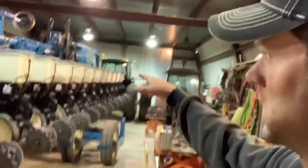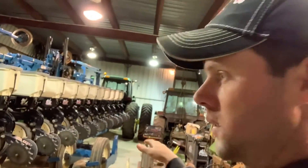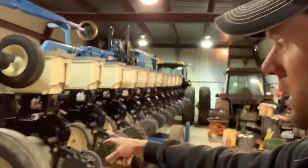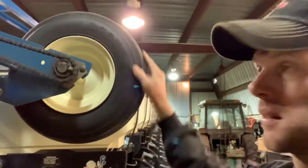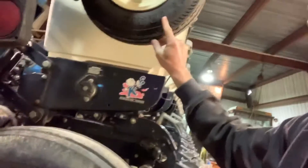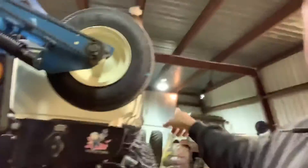Of course you also have wing locks — you have a center section and a wing on each side. The wings make it so that when you're going over uneven terrain, it will let that side go down on the low side, whichever side is low, left or right. See these tires on the end here that are in the air? This actually drives the planter — this makes the planter put out seed. That's running it backwards, but this tire when you let it down will come in contact with that one, and when they're turning, these units are putting out seed in the ground.